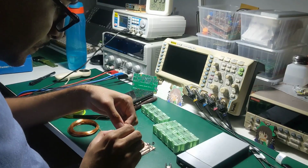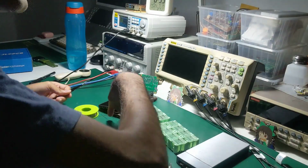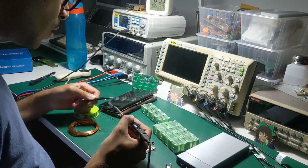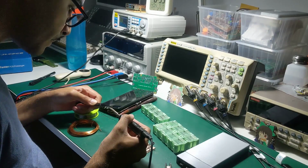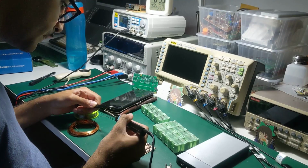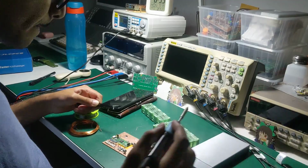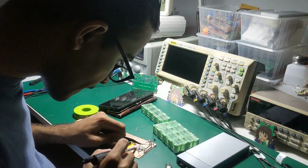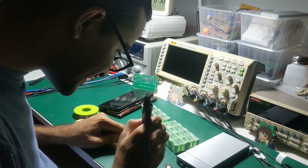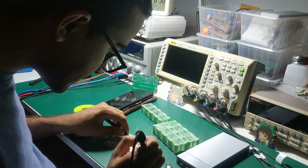I remember I made one of those, very simple. You have a current transformer, a handwound small high frequency transformer, two or four BJTs, and that's it. I have no idea what I made. It was basically a mains to DC supply, whatever architecture it was. My PCB etching then was very bad, so the current transformer fell off, and the thing exploded, shutting down not just the breaker for the room, but the breaker for the entire house. And the GFCI tripped as well.